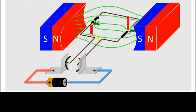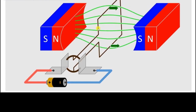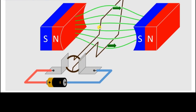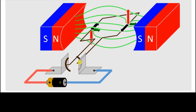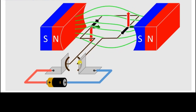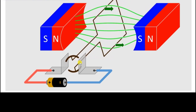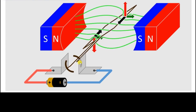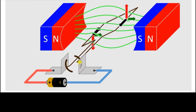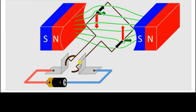And if the number of turns in the coil are increased, or if the magnetic field strength is increased by using a stronger magnet, the coil would rotate much faster. This DC motor converts electrical energy into mechanical energy. We also have another device that does the reverse, converting mechanical energy into electrical energy, and that is called an AC generator. If you're interested in knowing in more detail how an AC generator works, you could look at the video coming up on your screen. See you in that video.